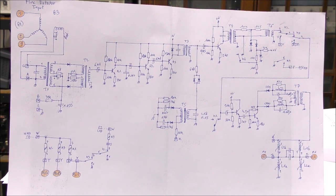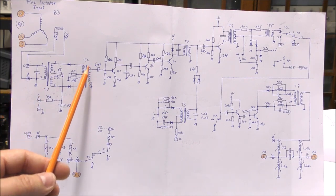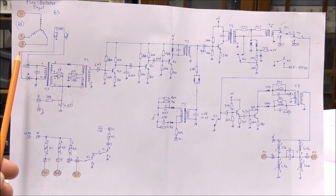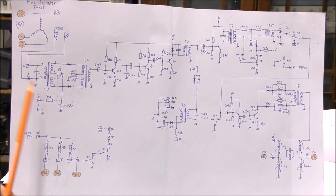This is the schematic diagram of the slaving amplifier. It is more complex because the input voltage is a signal at 800 Hz. This is a control transformer connected to the flux detector. The signal at 800 Hz is fed to this transformer, and there is a capacitor which permits to tune the circuit to 800 Hz. At a second input there is a signal at 400 Hz — this is the second input of the mixer. At the output there is a signal comprising the sum and the difference of these two frequencies: a component at 400 Hz corresponding to the difference between 800 Hz and 400 Hz, and a component at 1.2 kHz corresponding to their sum. We are only interested in the 400 Hz component.